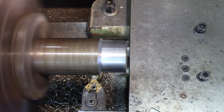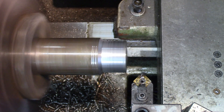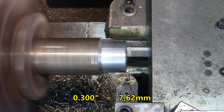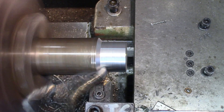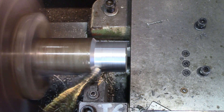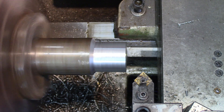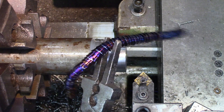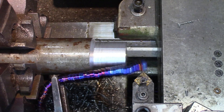Re-register, zeroing there. We're at 250 thousandths. Let's try it for 300 thousandths — a little bit too much. Okay, we're at 300 thousandths now. Not bad at all. I would say those inserts are doing a decent job. Maybe you'd like to see the last chip we got from it — it makes a long chip though, it didn't cut the chip. I would have to play with the advance a little bit. But this is a hot chip. Nice colors, though.